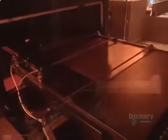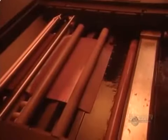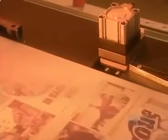A plate is a plastic-coated sheet of aluminum, just 0.3 millimeter thick. It goes into the cylinder of a machine called the imager. The imager's laser beam scans the plate, hardening the plastic coating wherever the computer tells it there will be text or pictures. The coating in the blank areas that don't harden then washes away in a series of chemical baths. It takes about a minute for a plate to pass through those processing basins.